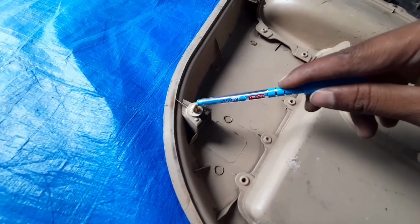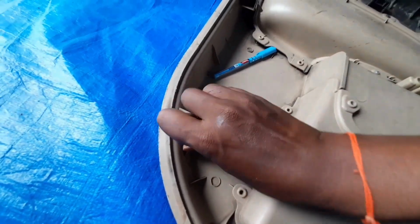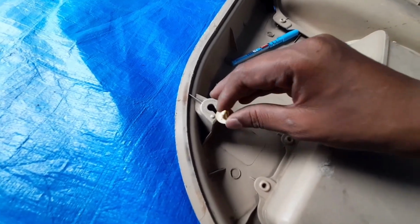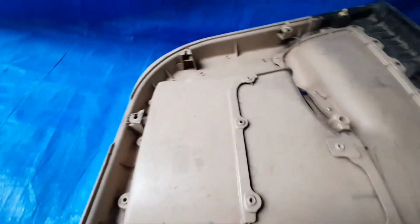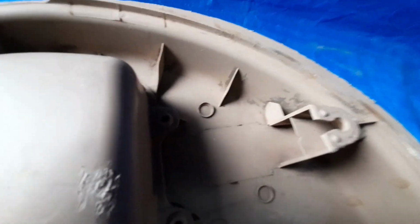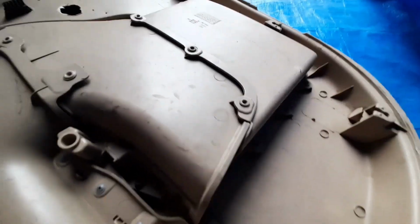So now the retainer pin is fixed with the doghouse. So this one is the doghouse. This rib is provided to restrict this pin. Next, now I have to make this feasible for tooling, so how to make it feasible for tooling? Because we have to assemble the individual parts one by one, then you go for the assembly, sub-assembly and final assembly. Now to make this part feasible, you have to do the tooling feasibility.